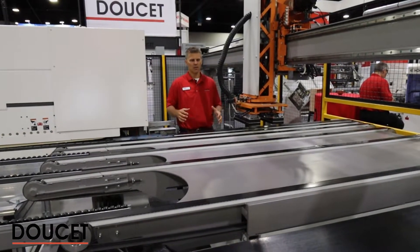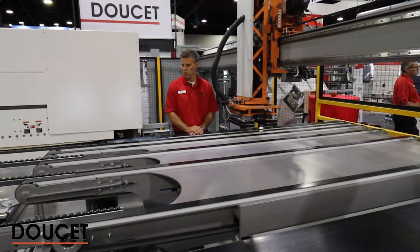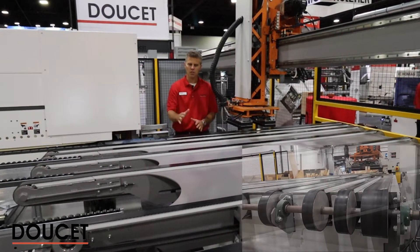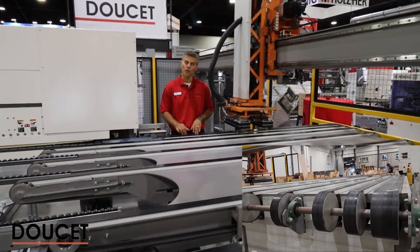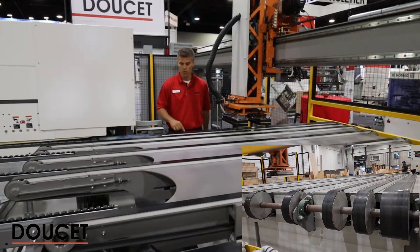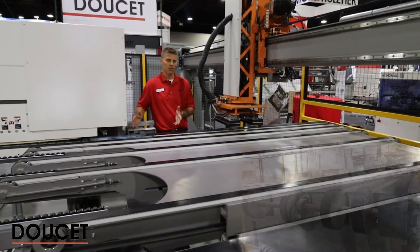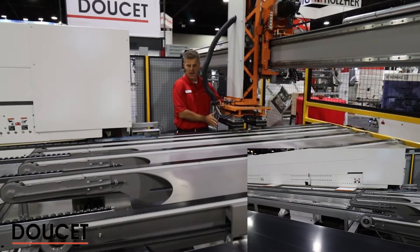The RETEX working cell includes different parts of the equipment to make sure the cell works correctly. The first one is the receiving belt. The receiving belt is controlled in speed, matched with the bander. The first belt is wider and can handle widths as narrow as two inches. We match the speed based on the size of the part to stop the piece under the head axis.